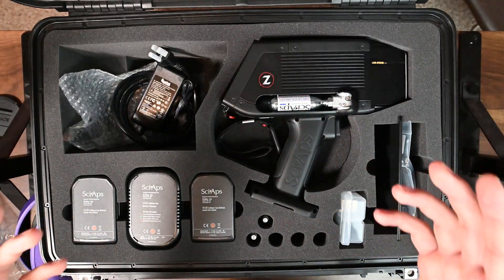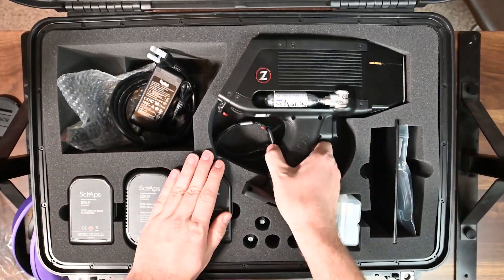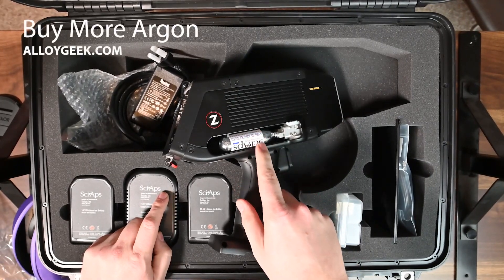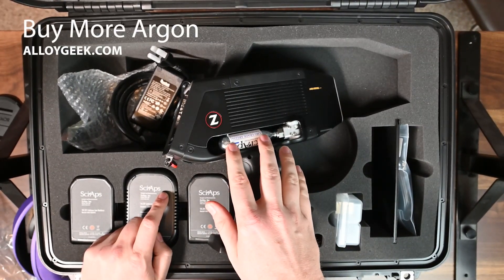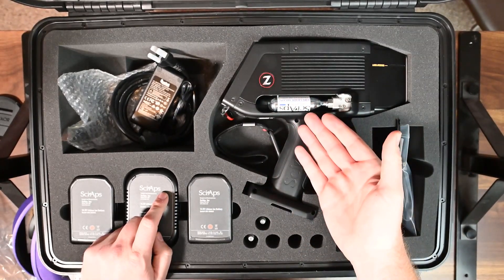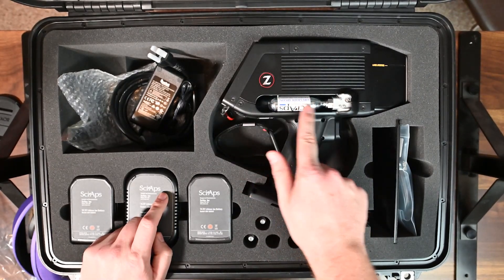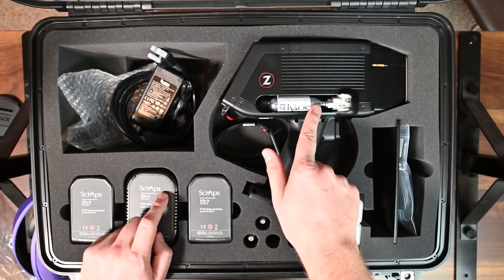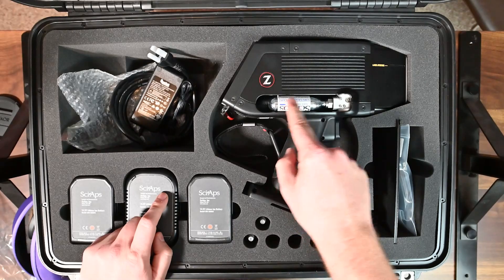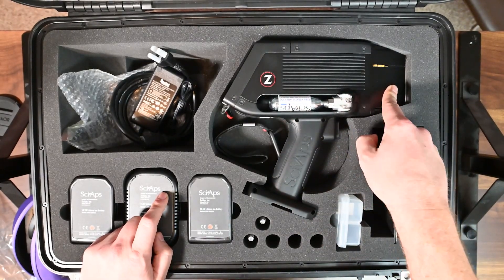Just look at this case — you have a nice big cavity to catch the extraneous stuff, but most things like the analyzer and batteries just look great. It's a great presentation. Stay tuned — the next video is going to cover how to take your first LIBS reading with a Z902, and there'll also be a video about argon management. It's really important that you understand the importance of argon. If your unit does not have argon and is a LIBS unit, that's called an air burn unit — it'll have a plastic black piece covering where the argon would go.